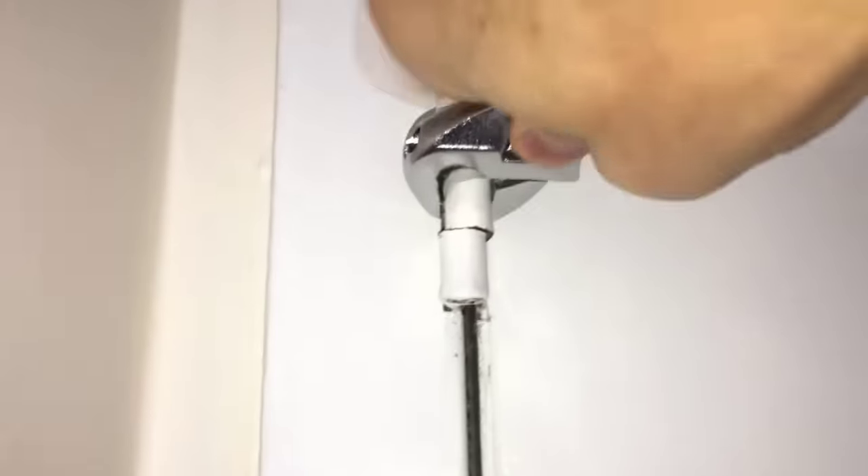This is a heavy outside door and it has pretty strong hinges to hold the weight of the door. So you would probably need to apply a lot of pressure, and possibly use both hands to bend those hinge loops. The top one has been adjusted far enough. Now let's adjust the bottom hinge part. There is no special formula on how far you need to bend those hinge loops, so you just have to eyeball it the first time, and if it's not good enough, bend it more the second time. The bottom loop of the hinge seems like it can use a little bit more bending.